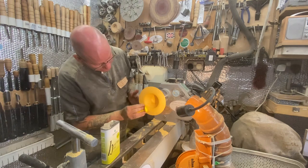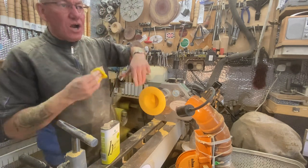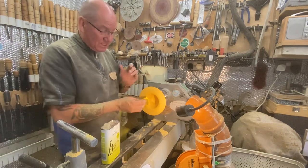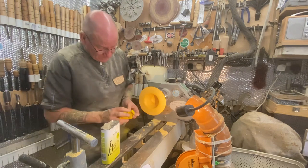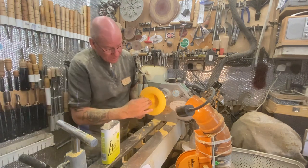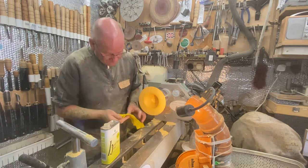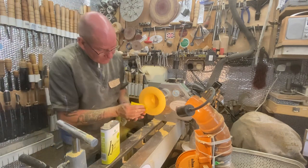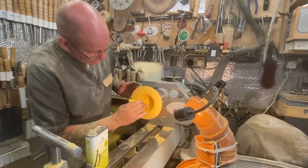Right, anyway, guys, what I'm saying is, just don't get it over hot, keep feeling your wood. This wood's cold. Have a feel if you want, this is cool still, okay? I'm very lightly touching, but the wax gives it a really nice finish here. And the other side of it I'll do once I've turned it round.